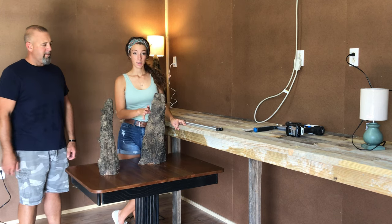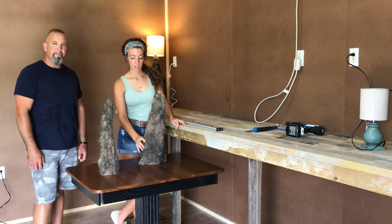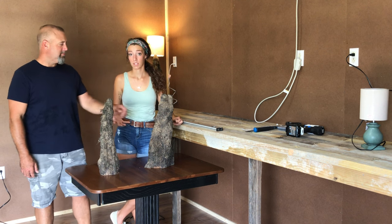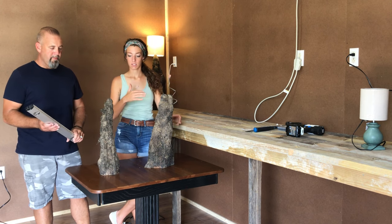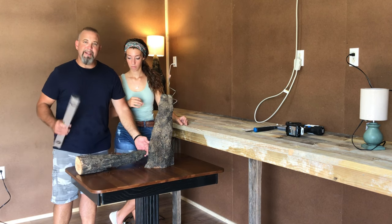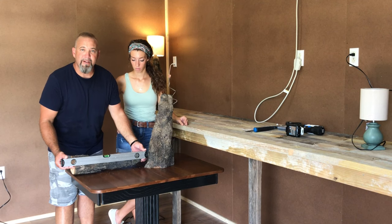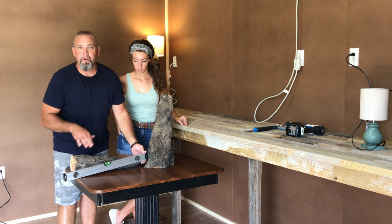These are the knees that we went down and cut yesterday. The first thing before we let them sit is we need to see if they're level. They don't have to be perfectly level because how they grow in nature isn't perfectly straight up and down. Our preference is to make it look as authentic and natural as it can be. So we're just going to check and see if it's close to being level. We take these and put them on a level surface, imagine a center line, and if you level it, this tells you where to cut the end square so it will stand upright.